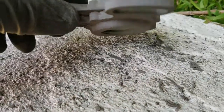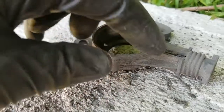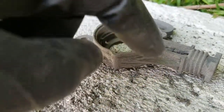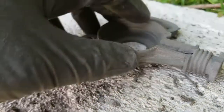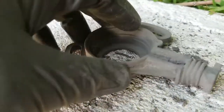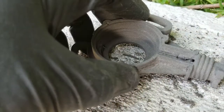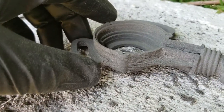I used a temperature of 173.9°C, and for the taller layers I actually ended up doing 174.0°C, which is pretty hot. For the most part my prints looked great. However, there was one spot in basically a two-centimeter square where everything had these little fused layers and it was kind of hard to pull apart — basically the powder just got too hot and started to melt on its own without the laser.